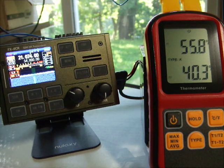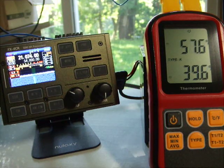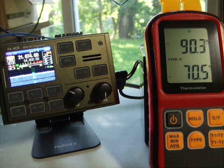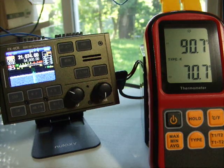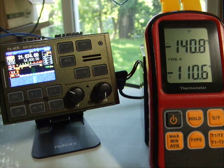There we go, we're transmitting now — a little bit less than that, 8.8 watts, good SWR going into my six-band vertical. Oh, what happened here? It just changed to centigrade when it transmits — the RF is whacking out the cheap Chinese thermometer, toggling it back and forth between centigrade and Fahrenheit. Wasn't expecting that — but yes, the RF is definitely causing that.